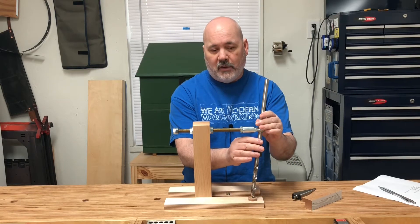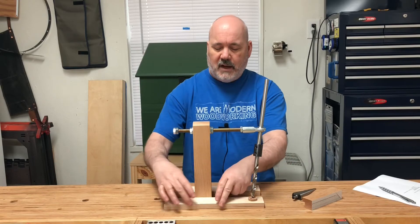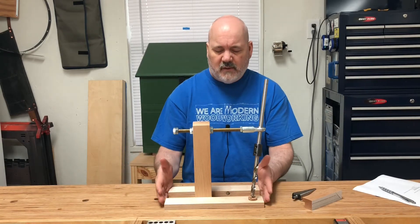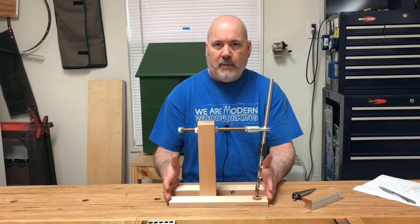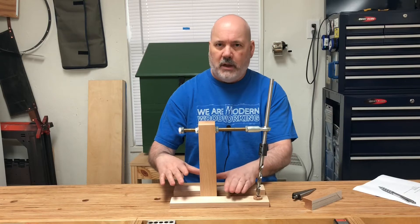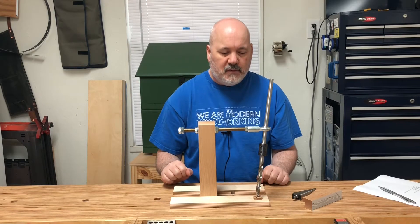The rod end bearing secures a shaft, so it locks in your angle once you get this jig set up in place. When you get this jig set up, you actually clamp it down. That's the design of these runners here — the runners are 2 inches wide. This design allows the jig to be nimble, so it can get into all aspects of a seat blank and easily be clamped, whether you're drilling a mortise for an arm post or for spindles. This design lets you get into those locations and still gives you plenty of area to clamp it down and secure it to your seat blank.